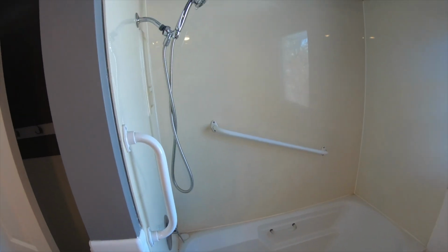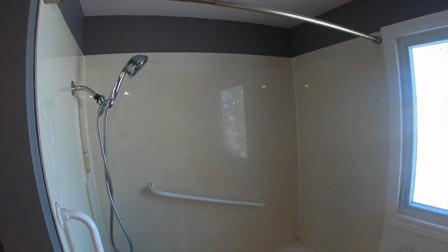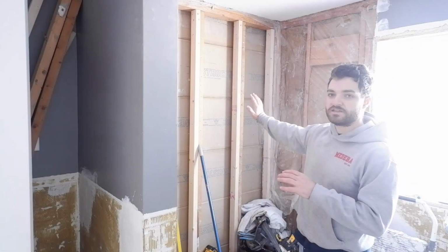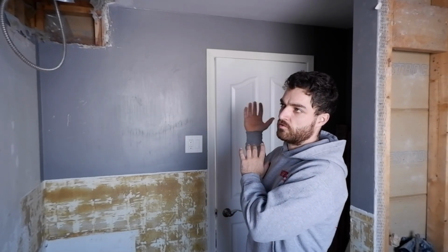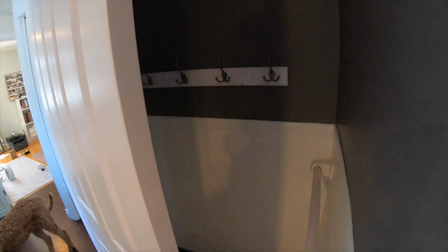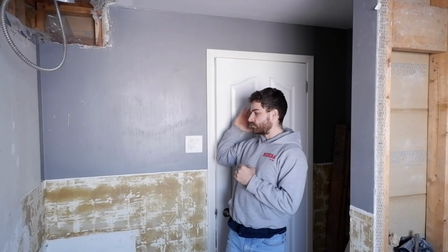Like I said, I've already spent a day here preparing some of the space. I tore out the tub and a little bit of miscellaneous stuff in preparation. You can see that I framed that back wall with new studs to make it straight because it was pretty out of whack. So the only real changes we will be doing is skim coating these walls, making them flat, doing a new tub surround tiled, and there'll be a barn door that goes where the current door is now, a sliding door. Just because in this corner there's quite a bit of wasted space with the swing of the door. So they're gonna put a barn door sliding this way, which will tuck in between the vanity and the wall here to free up this.